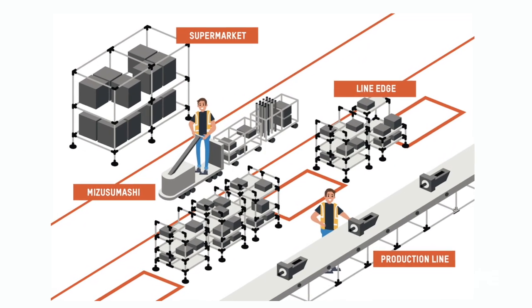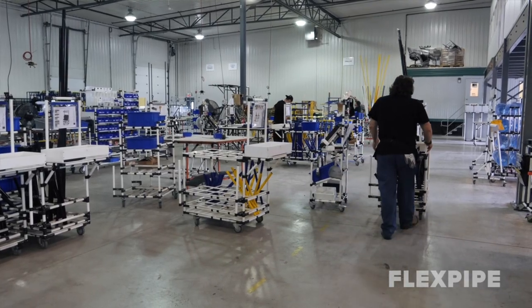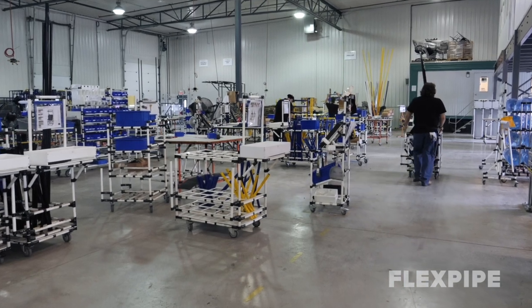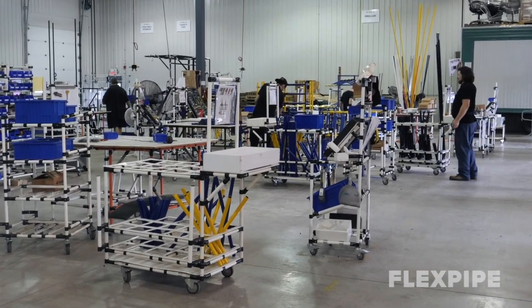The manufacturing supermarket should not be too far from the assembly line, and there may be more than one supermarket for longer lines. An exhausted water spider is a sign that something is wrong — try to identify and rectify the cause. As you can see, a well-organized water spider can help you boost your overall efficiency, potentially help you measure an ROI to present to management, and isolates auxiliary tasks which are mostly transportation and movement waste, thereby helping you reduce or eliminate these tasks entirely.